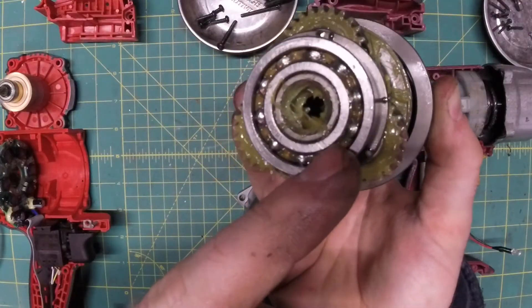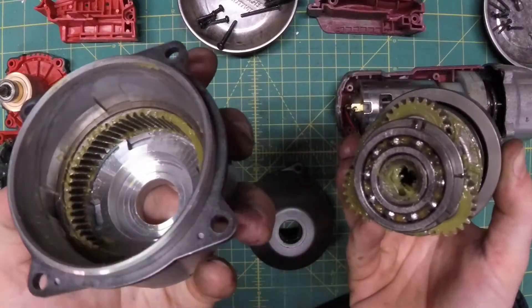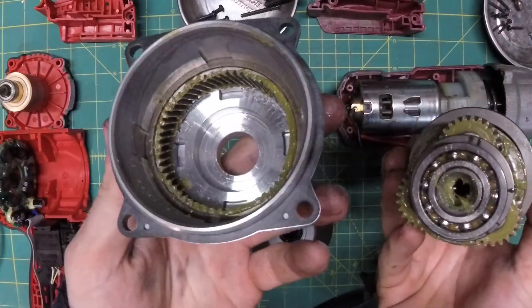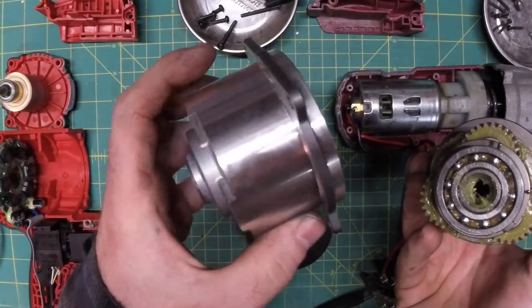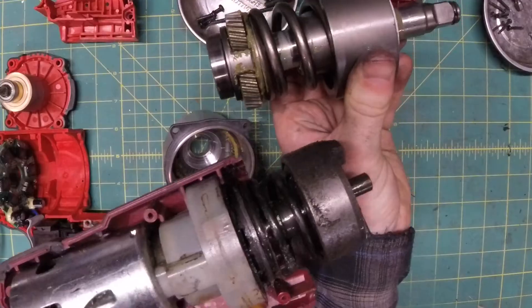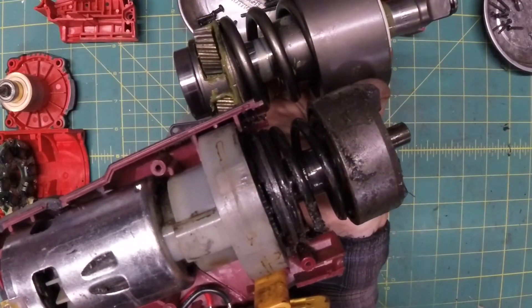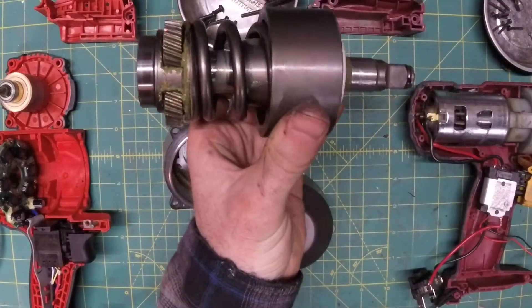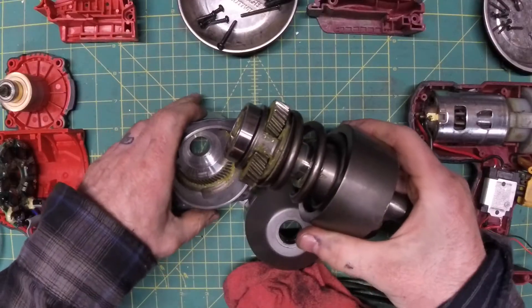Big beefy ball bearing in here too — not shielded or anything, but that's good enough. And here you can see the internal gear pressed into the aluminum housing — remember, this housing was plastic on the Harbor Freight model. No matter how powerful the motor is, it's the spring thickness that determines the maximum potential for your nut-busting ferocity. The weaker spring in the Chicago Electric isn't really a design flaw, but it really indicates that this is a beginner's tool, not a pseudo-professional tool like the Milwaukee.